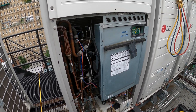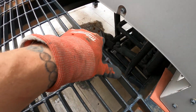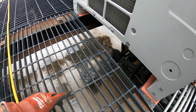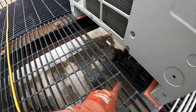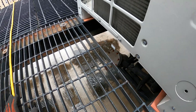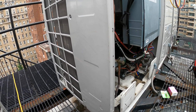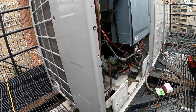It might also not have good oil returning. They added suction line filter dryers, and what happened is I opened some of these — there are no more filters inside them. They should have removed the casings. I saw oil being trapped in these casings. I made a proposal for all of these to be removed from the roof, but they haven't gone through with it. I told them they need to clean the entire building — all the units need to be cleaned. There's never been proper access, so they've never been cleaned in 12 years.